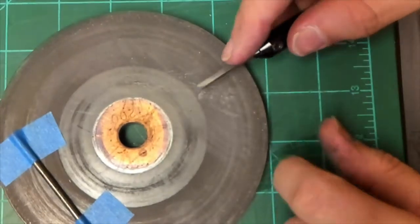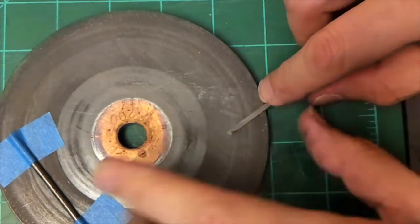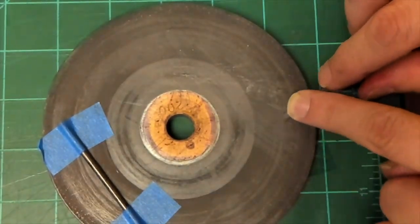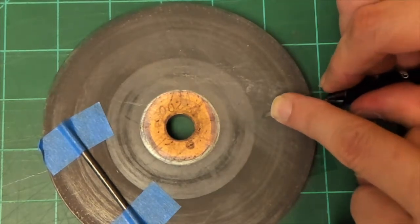As you sharpen the face, it will kick up a burr on the side of the face. So lay the tool on its side and just go back and forth on the 1200 or 600 wheel to get that burr off.